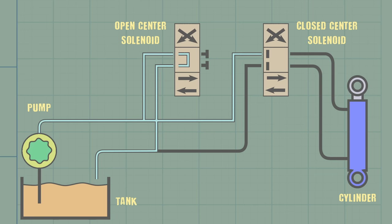Maybe we can hack into the hardware registers and change the pulse width modulation frequency. That's actually getting pretty close. This might actually work. I know I've said it about 30 times, but I think it's working now. Yes! What about reverse? Yes! Oh, that's fantastic. Okay, the yellow lights are the forward solenoids, the red lights are reverse.